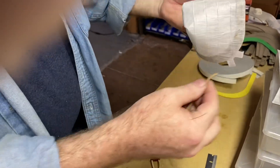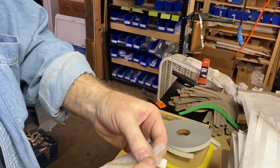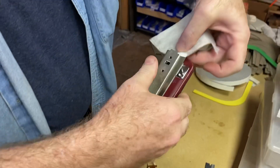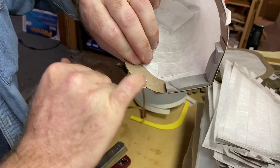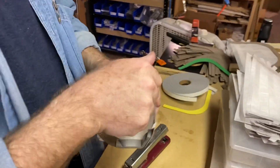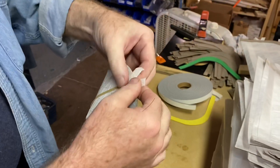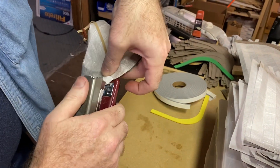Here's what we're going to do now — lay these across the mask this way. When they're in use they're going to go back that way, but this is going to help secure the rubber band in place. We've got tabs here that fold over the rubber band, and we're going to come in with a stapler, hold all that in place, and staple it down. Again, we're going to tap these down in a later operation. I'm going to do this operation several more times to secure the remaining straps.